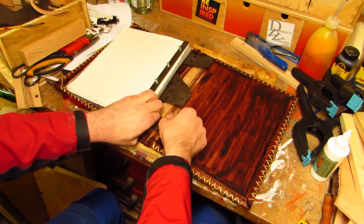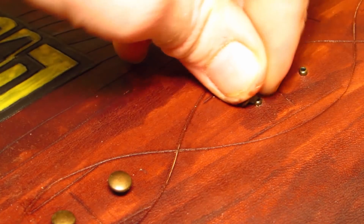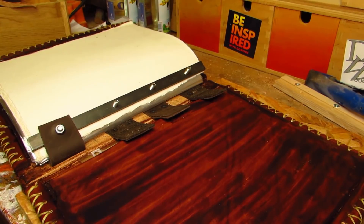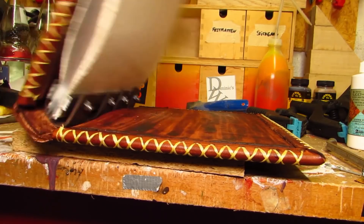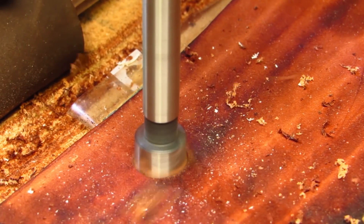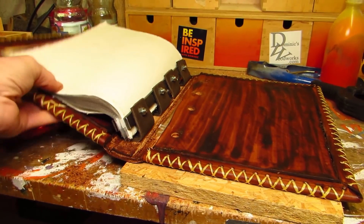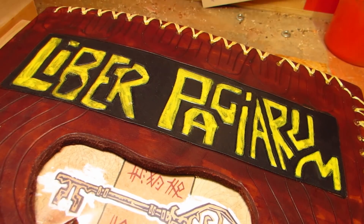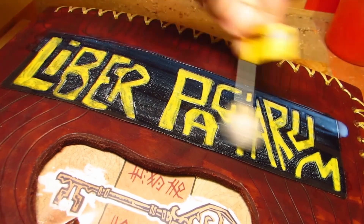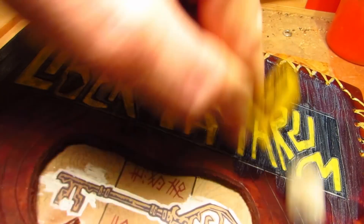Finally, we come to the truly riveting part of the performance — yes, the rivets. Placing pieces of hardwood underneath the spine, I add the caps and use a punch to literally hammer them home. After adding the nuts to finish attaching the page assembly, I realize that the screws are a tad too long for the book to close in a pleasing fashion. So I drill into the leather with a forstner bit to make some room while taking care not to hit the scroll. Now it works fine, at least until the next Kickstarter — and I think at that point I can remove a number of paper pages to make room. And as a final stroke — literally — I add an acrylic finish to protect the whole book.